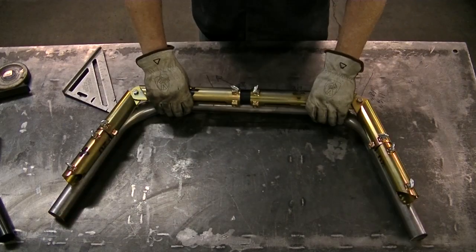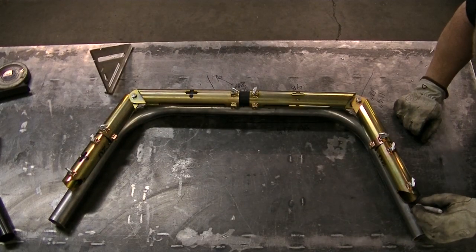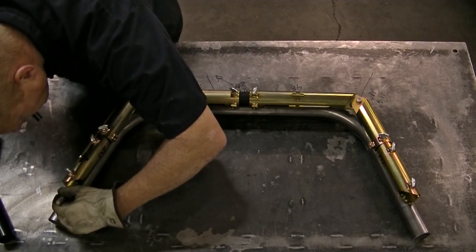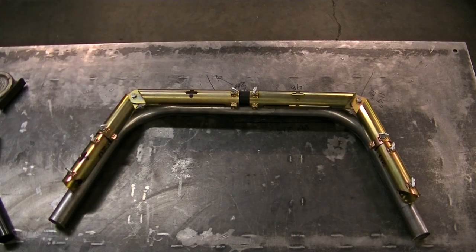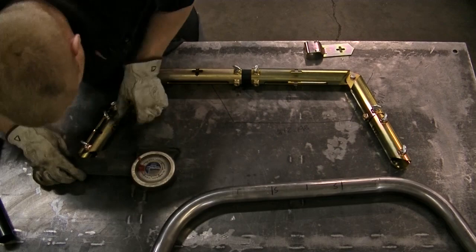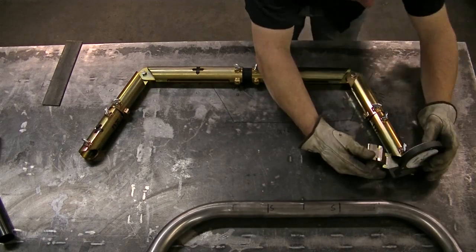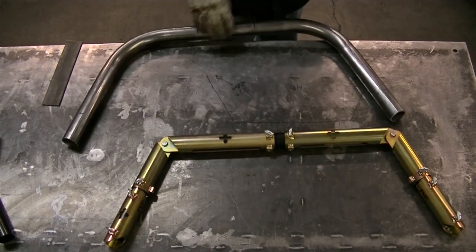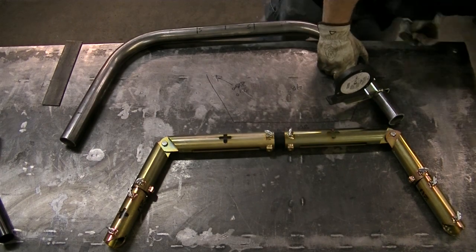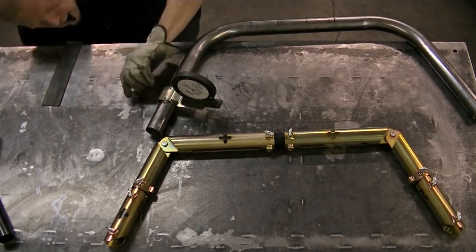While it's here I can actually just transfer where the copes go—I don't even need to measure the cope distance, I can just line it up and eyeball where the cope is. I'm actually making two marks here: one is where the notch is going to start and the other is where I saw cut it. The last thing I need is rotation of the cope, and this I do want to measure. I'll use a flat bar, stick it in the slots of the tube jig, and then set an angle finder on there and measure it—or I can use my fancy rotation gauge and do the same thing. I transfer the rotation marks onto the tube using that rotation gauge, using the far side of the gauge. It's got a little slot in it to make sure the sharpie mark is exactly in the center of the tube. The rotation came out to be about 8 degrees.